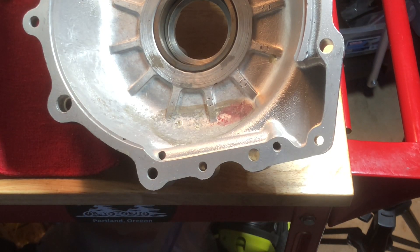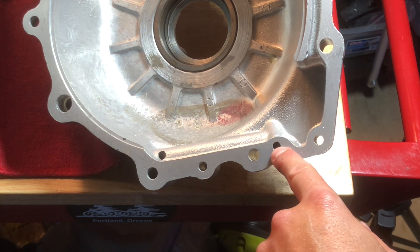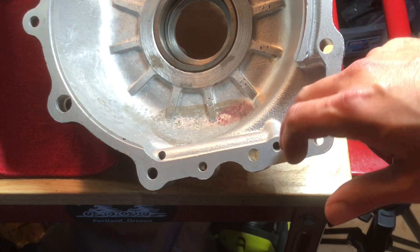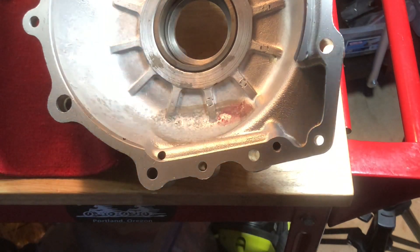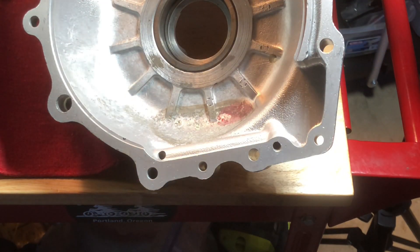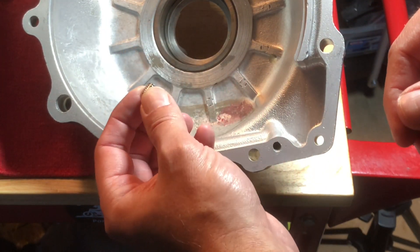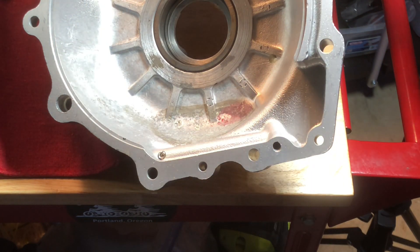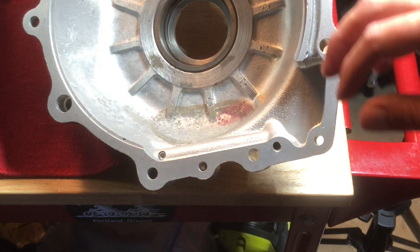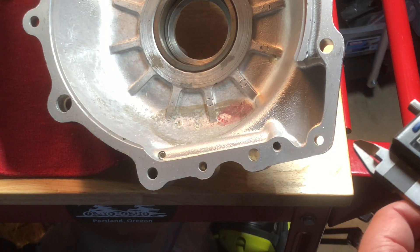Turning to the inside of the crankcase, the preference is to block up this oil return hole — this will be the new oil return hole. Because the flange has been machined away on the opposite side of the crankcase, this hole is now exposed. This plug is far too big. I did try to find a quarter-twenty set screw, but unfortunately it's not going to seat well there. I'll have to find a different solution; I'm probably going to try a 5/16 set screw, and I'll still have to drill it out a little bit. I'll be using something like JB Weld to keep that well in there.